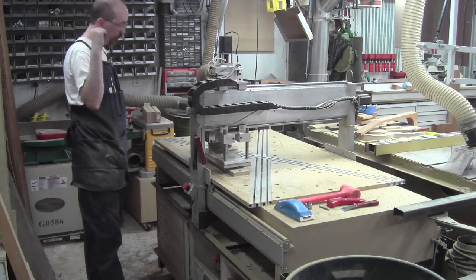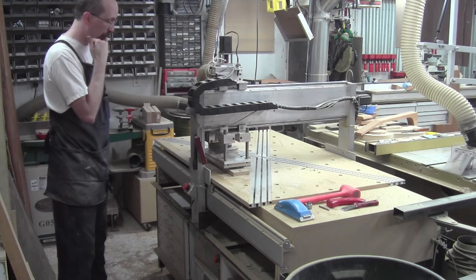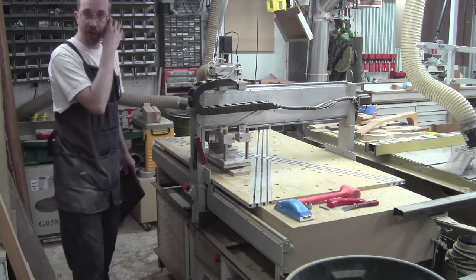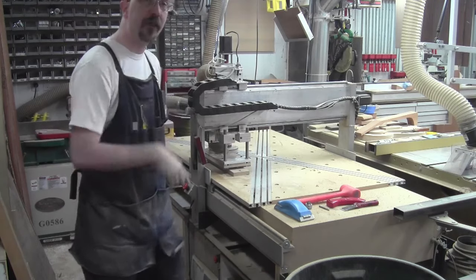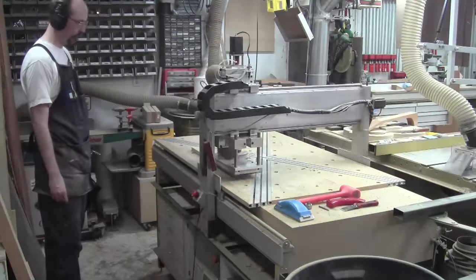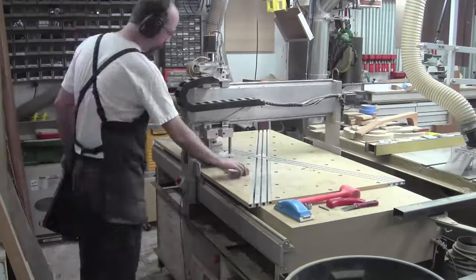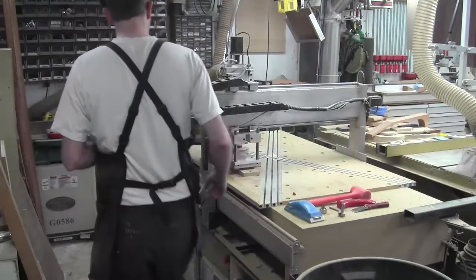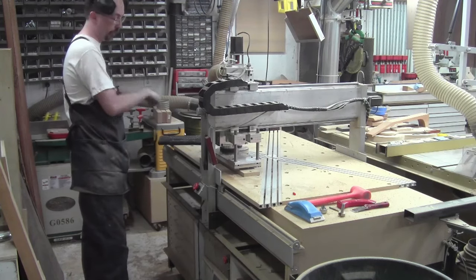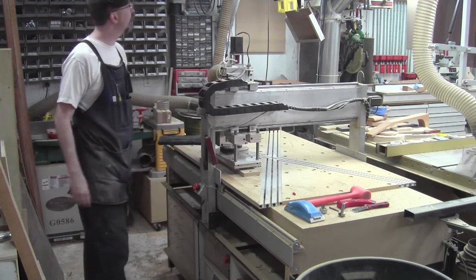So I got a little G-code. This will not take long at all to run. This might maybe take 2 or 3 minutes. But we're going to flatten the top of this and then see where we are after that. But I think it'll be flattened and then V-carve the groove. So I'm going to get it going now. All right, it's flat. And now we've got a V-bit in there. This is going to take a lot less time too. This is going to be one big line and a little bit of lettering, but otherwise this will be the last cut and we should be done.